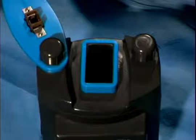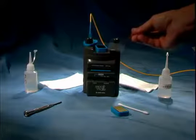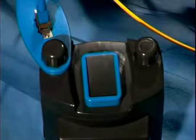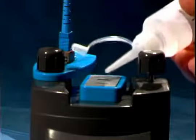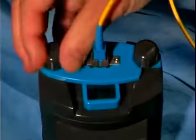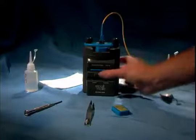With the tweezers, remove the film from the pad and replace it with the final polishing film, HFRM. This film is clear and should be installed with the sticky side up. Press the film in place and this time use a drop of distilled water on the film. Slide the fixture closed and tighten the thumb screws. Make sure the timer is still set at 30 seconds and press start again.